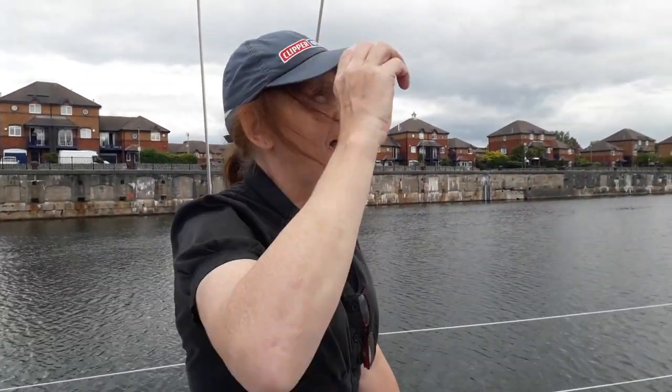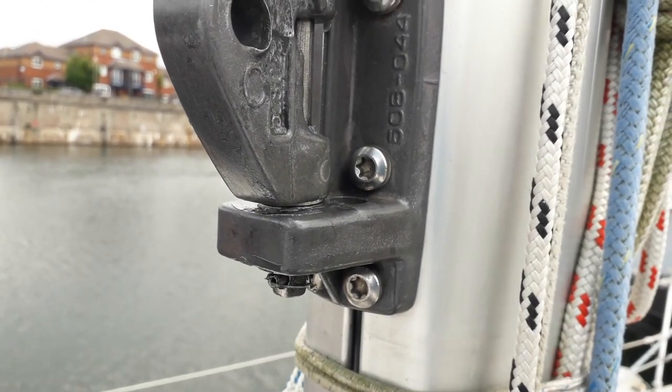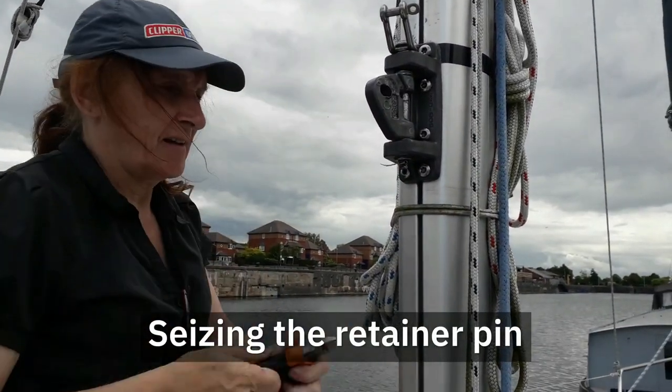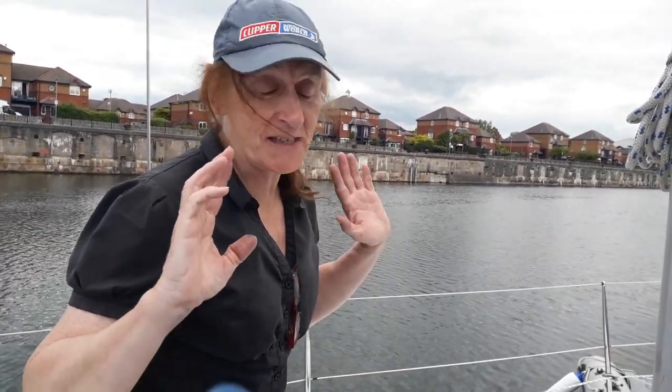We've greased the gooseneck and all its fittings and put it back in. We've shimmed it out with extra washers and we have the new part on order. The main bracket where it attaches to the mast is in fairly good order — it is also showing its age, being 20 years old. If we have to, this can also be replaced, but I don't think we need to at this point. The new bracket's on order. We're going to fit the boom back onto the gooseneck and hopefully get the sails up.